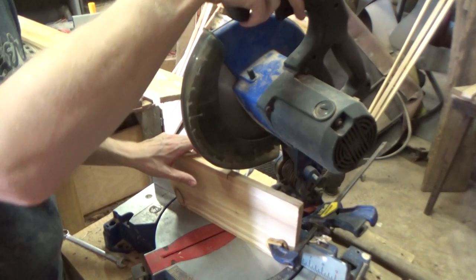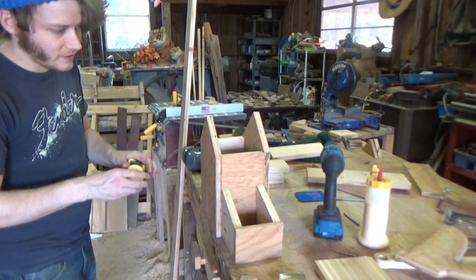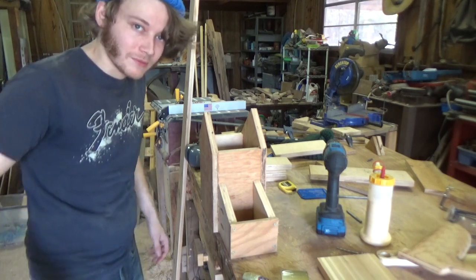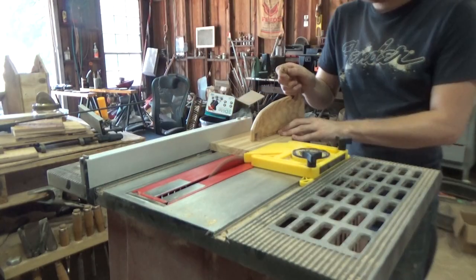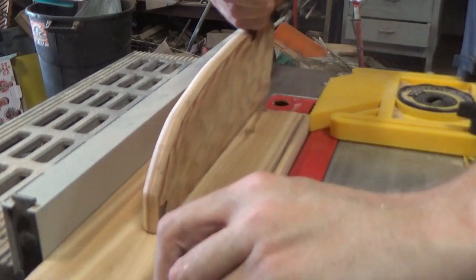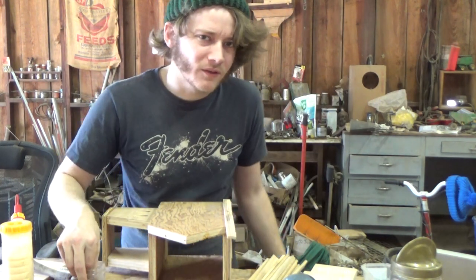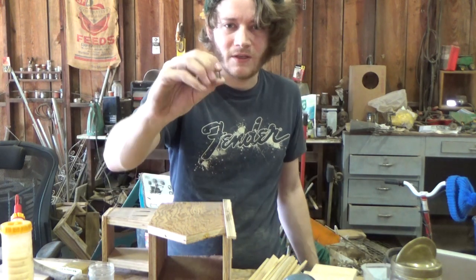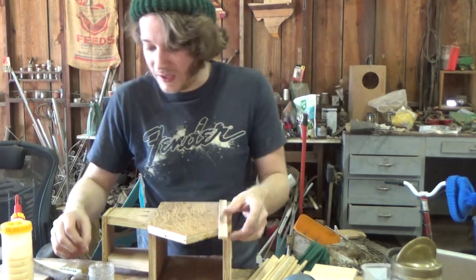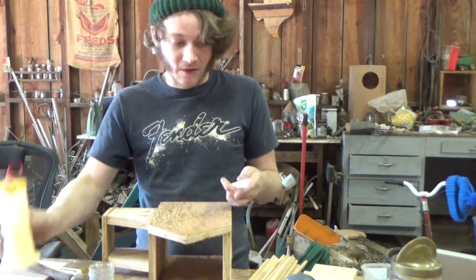I've got a piece of my cedar and I'm just gonna cut out a small section for that roof. I want to get to cutting my thin strips of cedar, so I'm just gonna start by measuring the highest point — about a foot tall. I'll mark about 12 inches on that and start ripping down strips. I have enough cedar slats now cut to cover both the front and the back. I don't feel like waiting on glue to dry — so instead I'm gonna use these itty bitty tiny nails. They'll be able to penetrate through the cedar and into the plywood, but not into the birdhouse interior. I'm gonna put glue on the slats themselves rather than pouring glue over the whole surface.